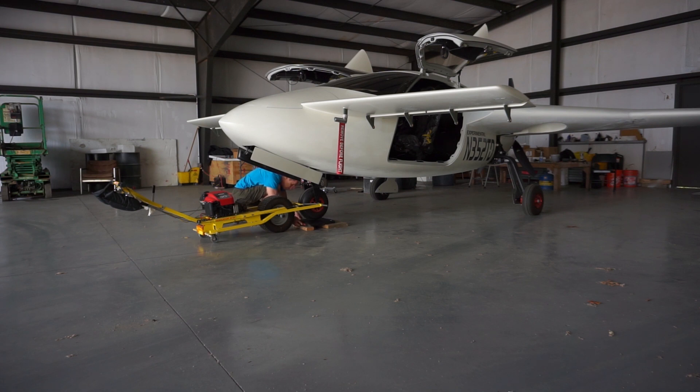The reason we want to know this is so we can look at Mark's calculations - which I showed you a couple videos ago - and pick an airspeed and an initial angle of attack to bring the nose to. Using his numbers and the measured weights, we can figure out exactly where we're going to be when the nose lifts off and when the main wings lift off.